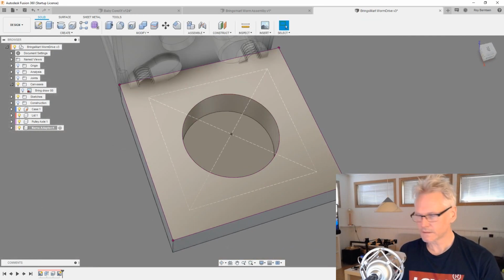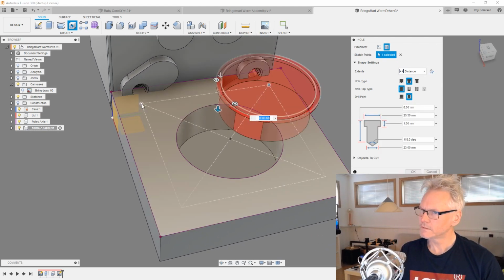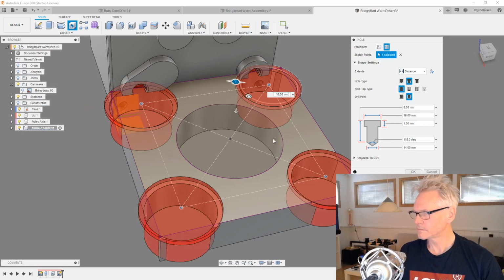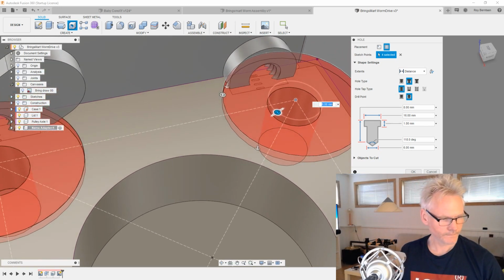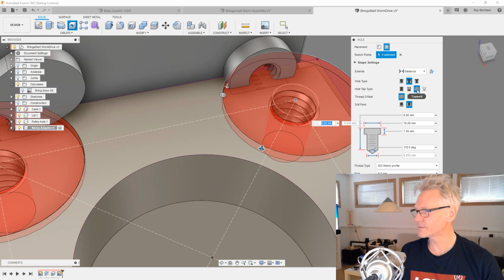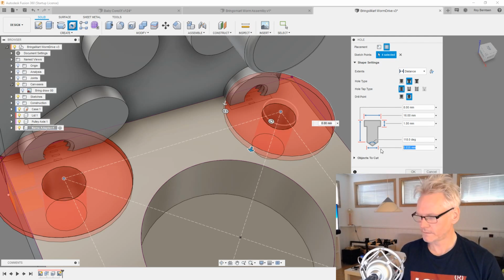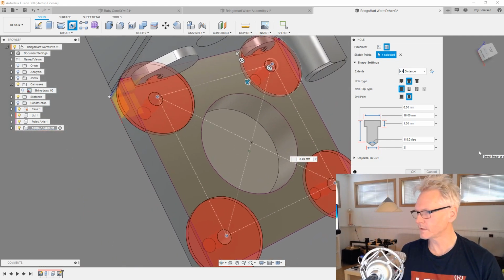So I'm going to finish that sketch and use the hole command again, and we are going to go with counterbore. Just going to pick the corners. Let's do the inner first. Actually, we have tapped? They should be, no, they are not tapped. They go straight through. So it's simple, and they are 3mm. Probably more like 3.5, but anyway.